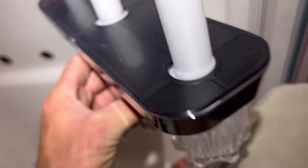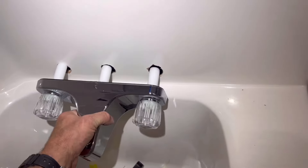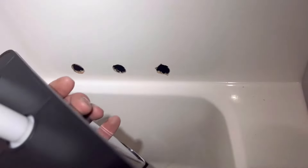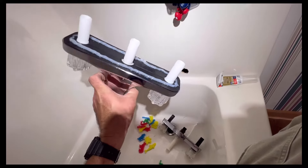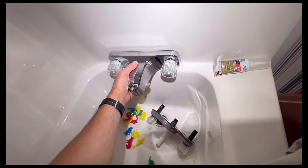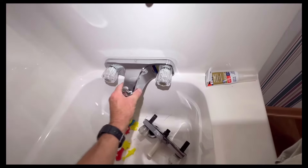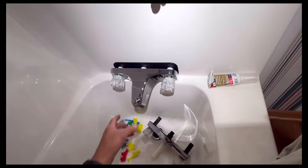That's clean. Now what I'm going to do is put a small bead of silicone all around the outside of this — just a little sandwiched in there to make a good seal. So put a little silicone around it just to seal it off, stick it in, go around there, let it hang, and then go around and pull it toward me.